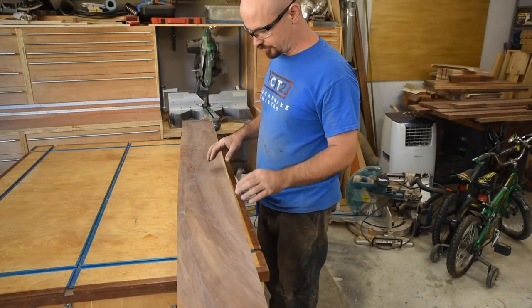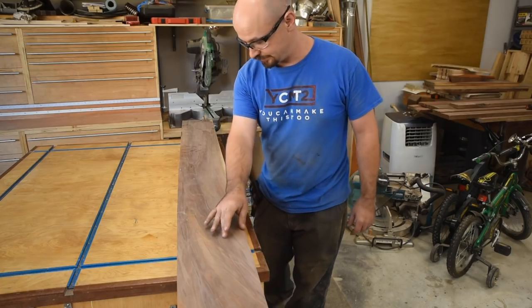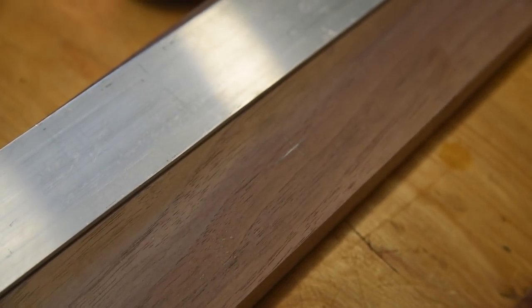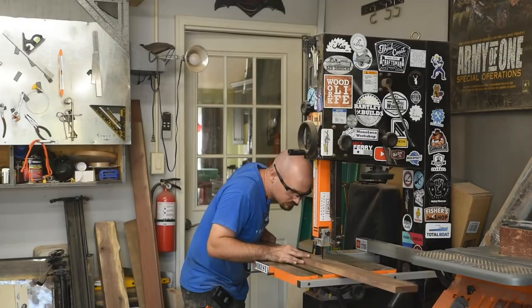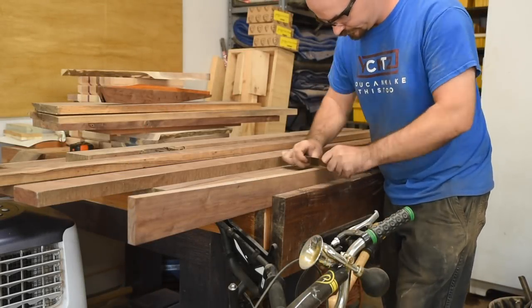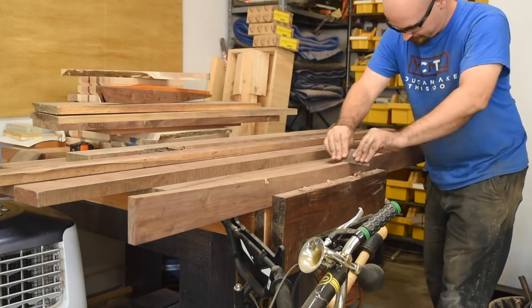I'm going to cut the front stretcher for the couch out of this piece because I'm going to have a small arch relief, and even on camera this board actually has some nice arched grain, so that'll help keep it nice and strong even with removing that material. To lay out the long arch on the board, I marked the midpoint and then used a long piece of aluminum as a drawing bow. Just use a bandsaw to cut the curve. To smooth out the cut, I used a card scraper. Hand sanding is also an option, but that doesn't give me the same burning feeling in my thumbs as a good card scraping.